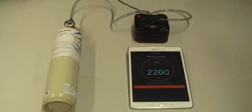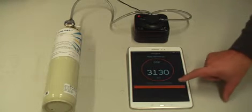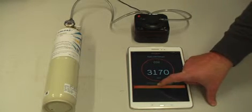The readings will rise. Once the readings become stable, roughly at the known concentration level, then we hit the span button, which calibrates it. So we can see at this point this sensor was slightly uncalibrated, and this is why we perform a calibration procedure. So we wait for the numbers to stabilise, and we hit span.